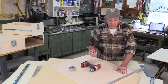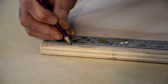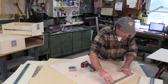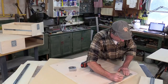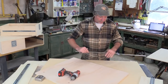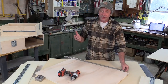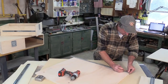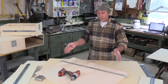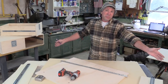We're putting in a total of five screws along this line, starting two inches from the edge so we don't splinter or split the side panels — then basically five and a half inches apart. Same goes for attaching the back — it's also a half inch thick, so measure over that quarter of an inch and make a line. Come in two inches from the edge and put five total in the back as well. If you're making this set of drawers larger, just put in more screws the wider and deeper you go.